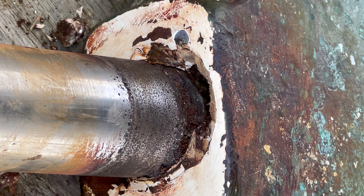One possible cause: where the lower ring seal — that white plastic-looking part — sits with the bearing above it, you've got a void, an annulus underneath, a cavity which is not properly filled or shouldered. Water will sit in there, and when the boat heels over it fills with salt water that doesn't move. When water sits static in a cavity, the oxygen depletes from it, and stainless steel needs oxygen in the surrounding water to protect itself. Because there's no way for the water to drain out of that cavity, it sits there while the boat's in the marina and quietly corrodes the stock. That's one possibility — I really would like Jeanneau to tell me what's going on and what they're going to do about it.